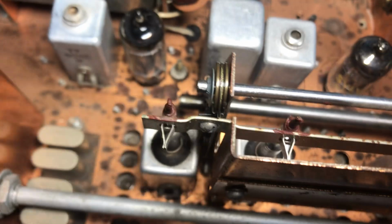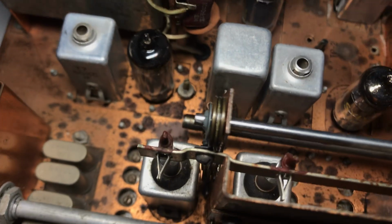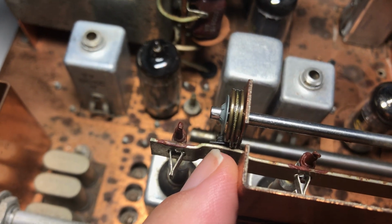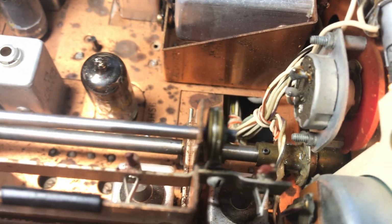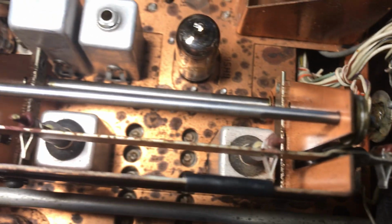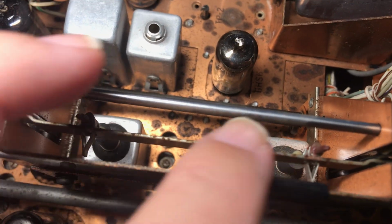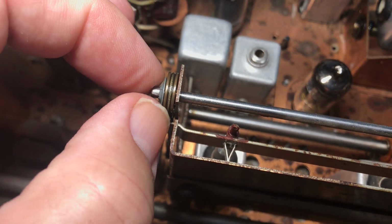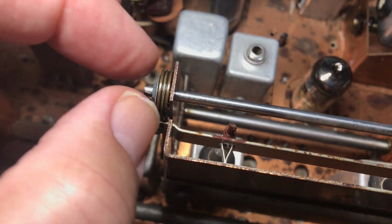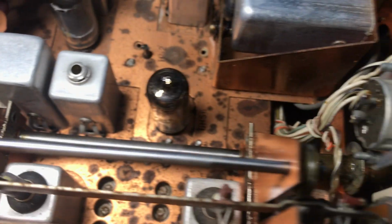Well, that solves that. So again, you want to make sure these are going in straight. You want to take this cable off first, take them off the driver cable, just go up and down manually and see if they're binding or not, and make sure they're straight before you put the cable back on. So make sure this bar and these little springy things that hold these slugs are straight with no cable connected. Make sure these pulleys are lined up and that they are free to move with some WD-40, and make sure they're not binding on the side.